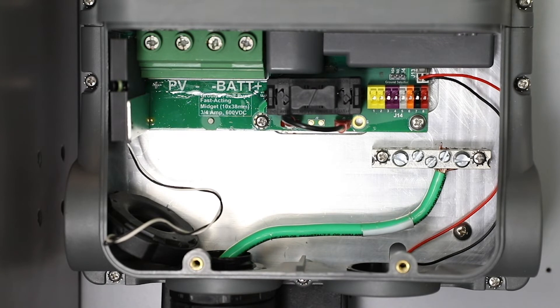Note: the FM100 AFCI uses a jumper to create a negative-to-ground bond that enables the built-in ground fault detection and interruption circuit through the GFDI fuse. If an external GFDI is used, or if the controller will be in a positive ground system, this jumper must be removed. Failure to do so will damage your controller.